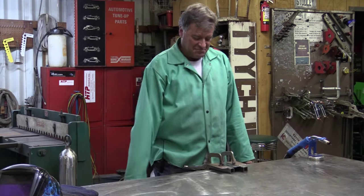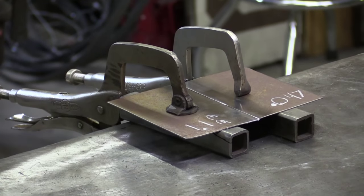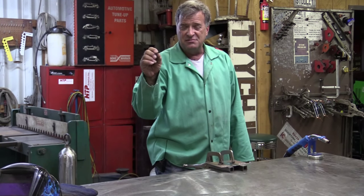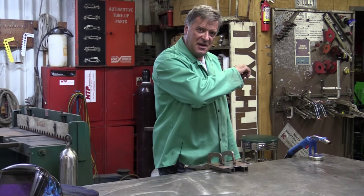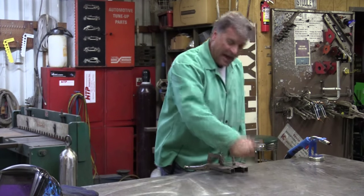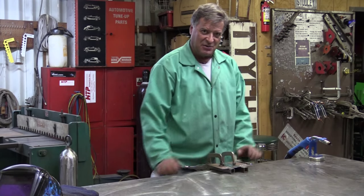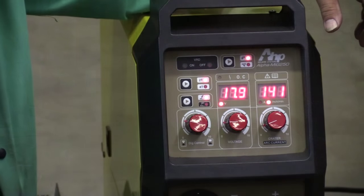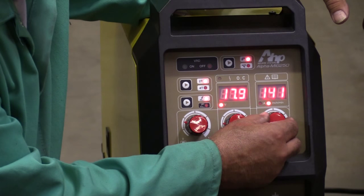Okay Mike, you asked — here it is. I've got some 0.047 inch steel, just mild steel, that's about 18 gauge. I've got 30 thousandths wire in the machine. Let's fire it up, let's see what we get — turn it down. Got a nice air gap in here, not on the thick table to sink any heat away, so all the heat goes right into that 18 gauge. Off the MIG, let's find out with about 140 inches a minute of wire feed.